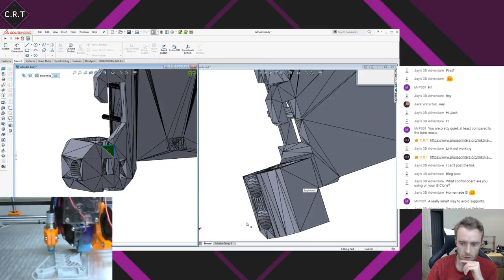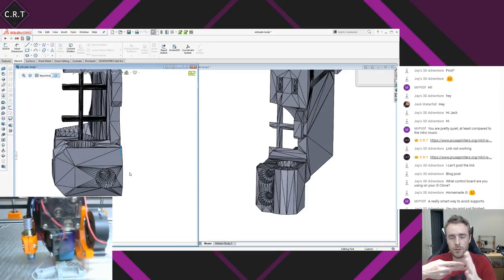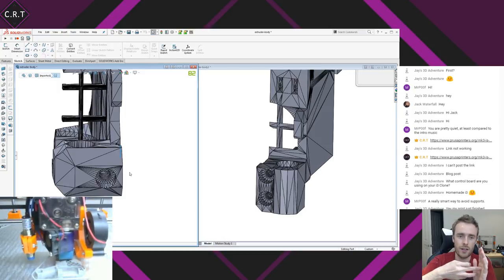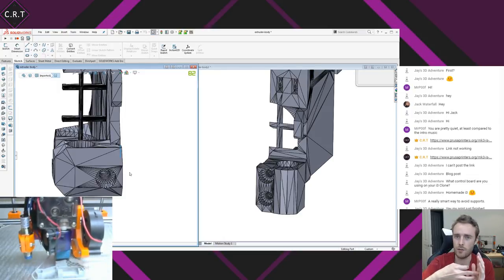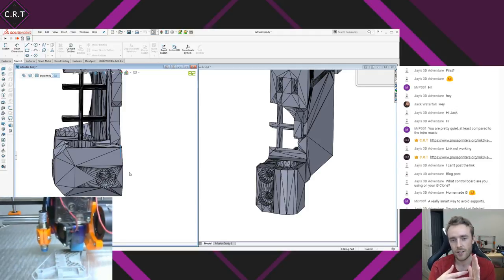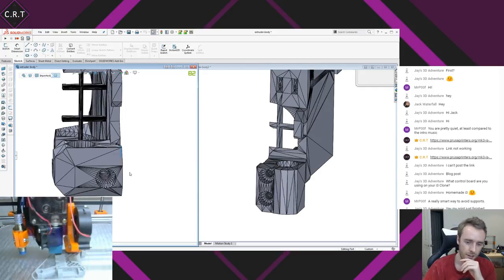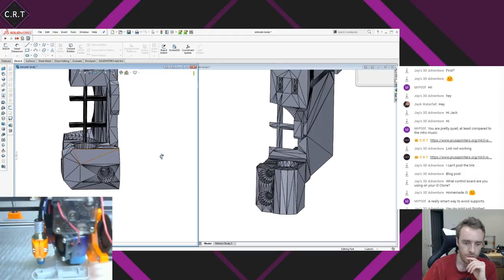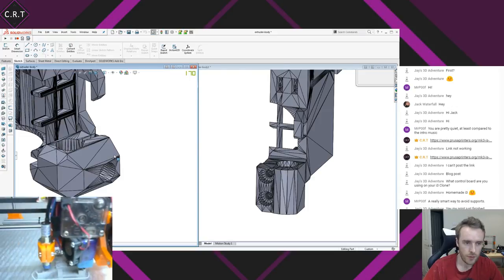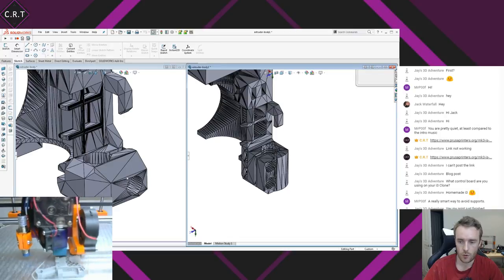I'm not sure entirely why. Obviously, they've reduced it to one screw. They probably found out the same sort of thing that I did. When you have two screws trying to hold a single clamp, when you tighten one, it obviously tightens it down, and then the second one will either be tighter or less tight than the first. It's very difficult to get them exactly the same, especially if you're doing it by hand. So one of them ends up doing nothing, therefore not worth putting it there. It does look quite a lot chunkier.